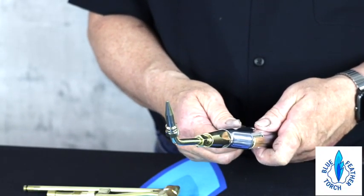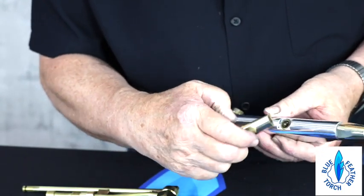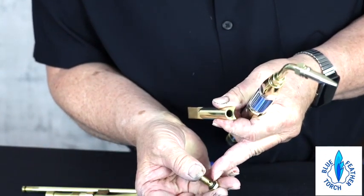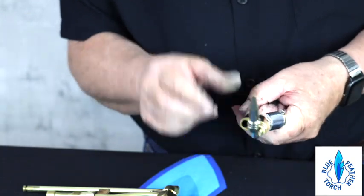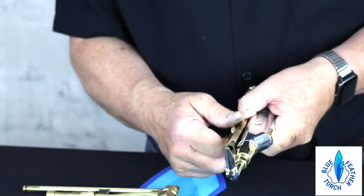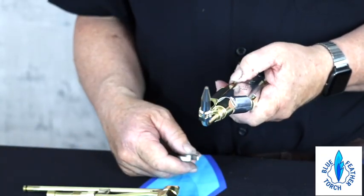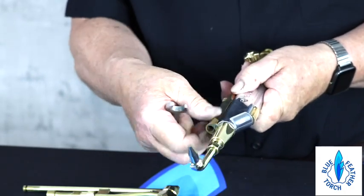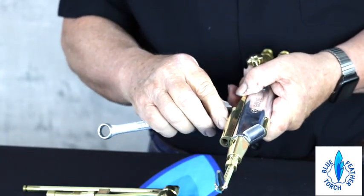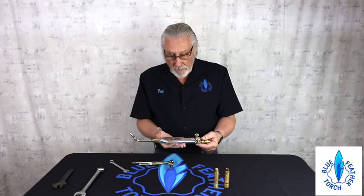Next, what I'm going to do is reinstall the shoe. Take this bolt out. There's an O-ring in the shoe and an O-ring on the bolt. This little shoulder goes against the O-ring in there. Take your bolt — it doesn't take a lot of torque to hold this. You can see I'm just using the end of the wrench, and I'll just tighten it up where the shoe is somewhat locked in place. It doesn't take a lot of torque, and everything is sealed with O-rings.